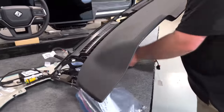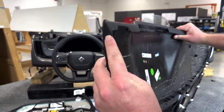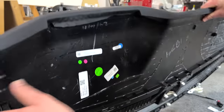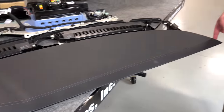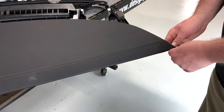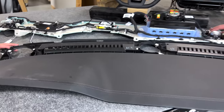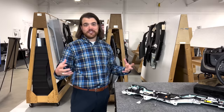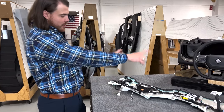Let's compare that to the Model S. In general I would commend the Model S for doing a good job, however they made the mistake of having a side face. That sewn seam and that corner are now fixed positions - there's one on each side of the IP. So if you're wrapping this IP, you have fixed position curves but now the entire outside length is also a fixed position. There's no ability for tolerance. This pattern must be made purposely smaller and then stretched to get the corners where they need to be. That whole stretch operation has to be done by hand, making it more labor-intensive than the design Rivian came up with.